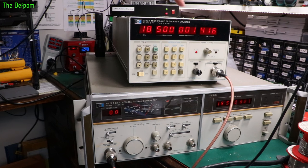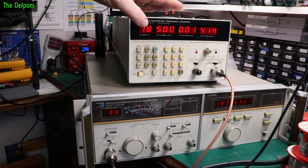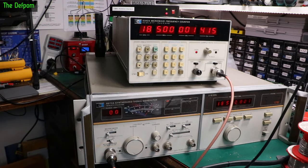So this unit is out by 1 kHz, and the other is out by much greater than that. What I should do is adjust this one to suit — get it calibrated — and then I don't need the rubidium hooked up anymore, and I'll be able to calibrate the other one instead to match. We should be good then.